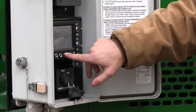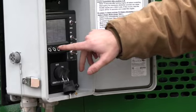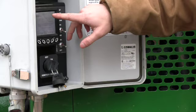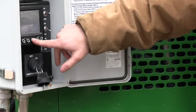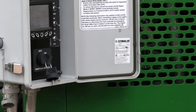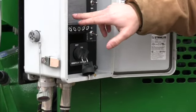So to get to that radio remote, I'll show you again when we're started up here. We have five buttons on this main screen. The middle button says mode. When we click that button, we come to a new screen. Now you see that arrow's on manual. If you click that same button again, it drops down to radio. If I were to start this up right now, it'd link up to our radio. We'd be live through the remote. If we were going tether, you guessed it, you drop down to tether. Tether runs that remote, and you're good to go. Now you see right now that's blinking and that symbol is on. All that's telling us is that that tether is not plugged in.